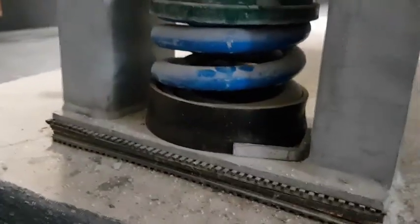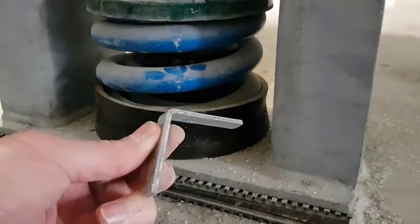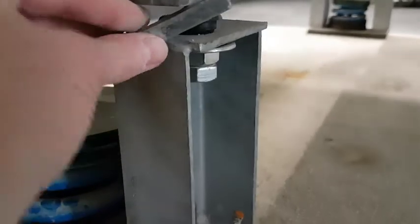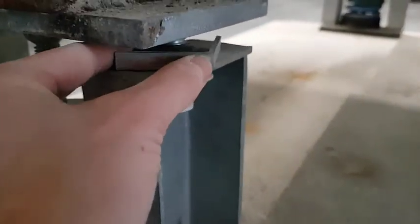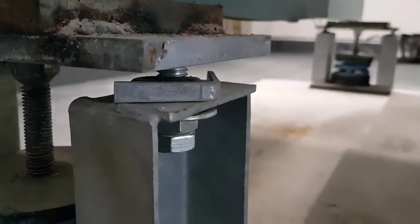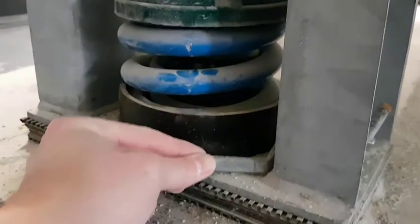You can see here one of the spacers that was mentioned in the datasheet and instructions. It would have been originally located between the top plate and the hold-down plate, like this. But notice here how much extra space there is. The CSR installation instructions say to remove the spacers once the top plate just lifts off. It appears the contractor here decided to go a bit further.